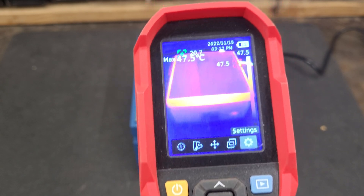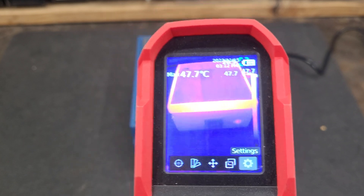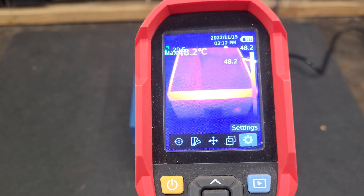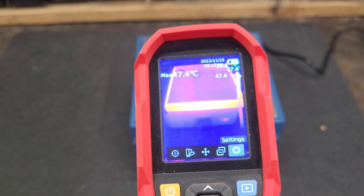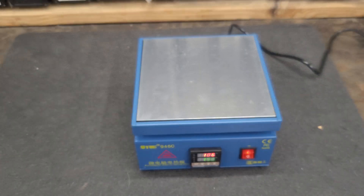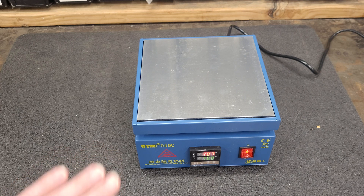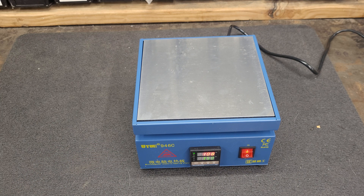I should be able to put the board on this and bring it up to almost the melting point — but there are bonding wires I don't want to mess up. I need to bring it up to almost the melting point of the solder, which we don't know on their solder. It's probably lead-free, so the melting point is probably around 210°C. If I get this to about 180°C that should be enough to let me flow some solder to get these electrolytics on. I was going to switch to tantalum capacitors, but I figured I'd just put the electrolytics I already ordered — you can't hit them with hot air, as I've had electrolytics explode that way.